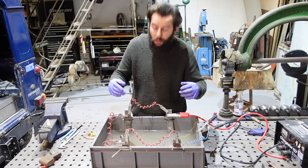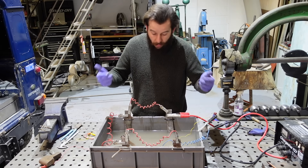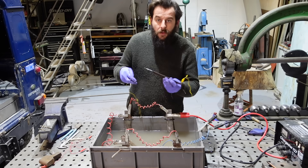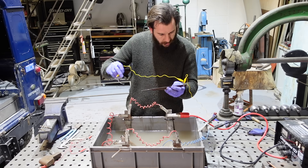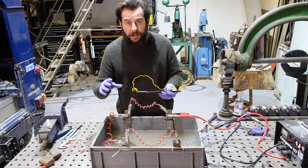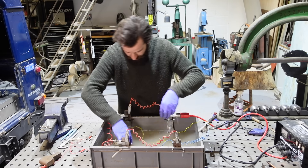The wooden handle — I'm not having to remove it from the hammer because it's not going to damage the wood. Wood doesn't conduct electricity. All it's doing is sitting in some warm cleaning water, which is absolutely fine — it needs a clean anyway. Make sure the actual part, the thing you're trying to clean, is completely submerged under the water and keep it as close as possible to the anodes.